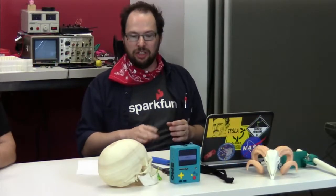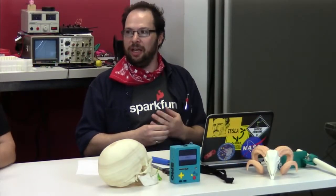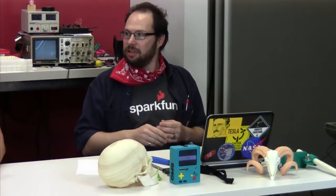And if you're really having problems with bed adhesion, you can also throw on some really fine, like 2000 grit sandpaper, and just give the PEI surface a little bit of conditioning. Another issue that can come up is binding.